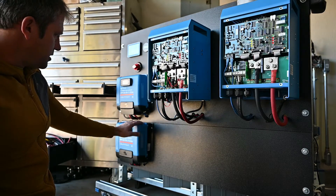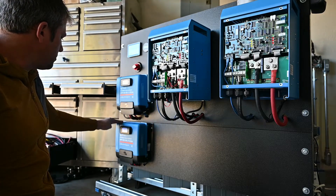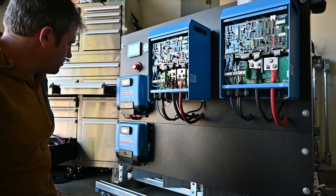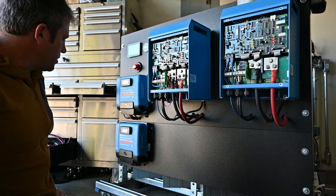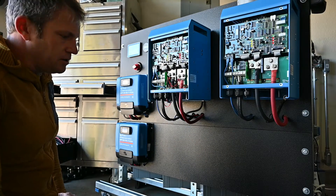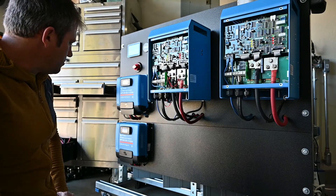The biggest update is that I added a second charge controller — same unit as the first one. It's the 250-100, so it's a 100-amp charger. This is a 24-volt system. This allows me to basically run one of my arrays that gets shaded a lot in a lower voltage configuration so that I can get more power out of each panel.